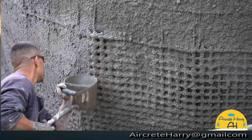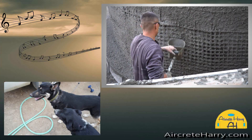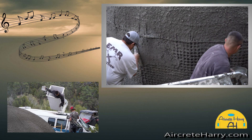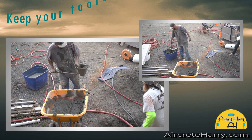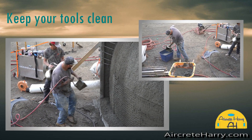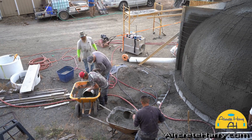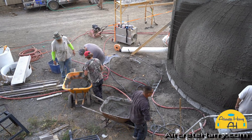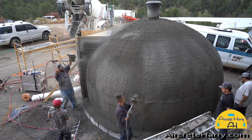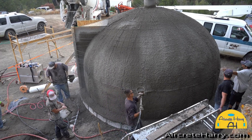It's really important to get all those holes filled up. Because of the mesh size, the outer part gets wet and the cement sticks to the outer part faster than it fills the center — that really just comes from having enough air pressure to blast the material in. Going behind the sprayer with a trowel is a great option because you can use that trowel to push the material in, making for better contact of the cement.